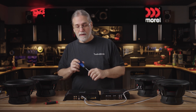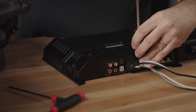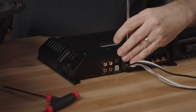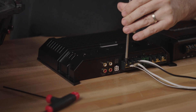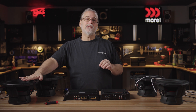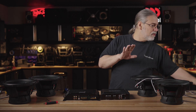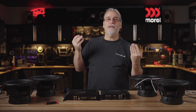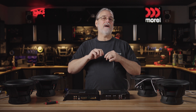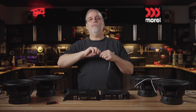That might be a desirable thing. So we can detach these other subs and get rid of our parallel guys for the moment. Take them out of the way. So now we're going to put these guys in series together. Remember, this adds up - this extracts less power from your amplifier. It's pretty straightforward wiring: we need to connect a jumper in between the two subs. We're going to connect the positive of one to the negative of the other. That's how the series wiring works - positive to negative, all the way down the loop.